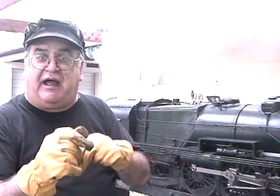Okay, that's the first pop off. It popped right on the 120, exactly where I set it on air. But now the blowdown ring needs to be adjusted because the volume of the steam changes that. So I have to adjust that up a little bit. Otherwise, it popped like a son of a gun. I'll get it to pop for you again.